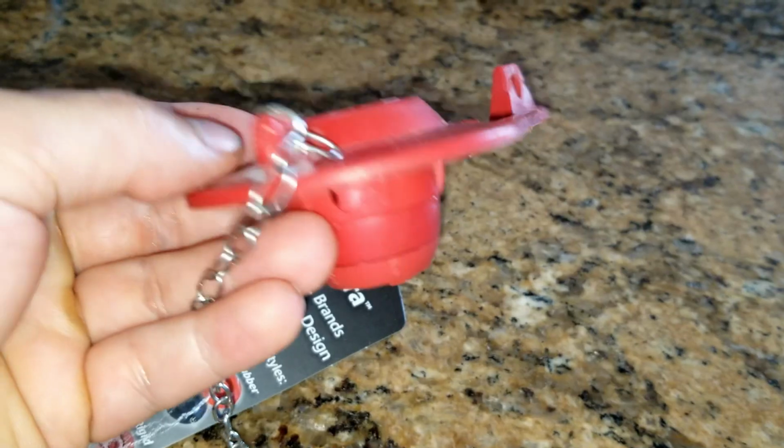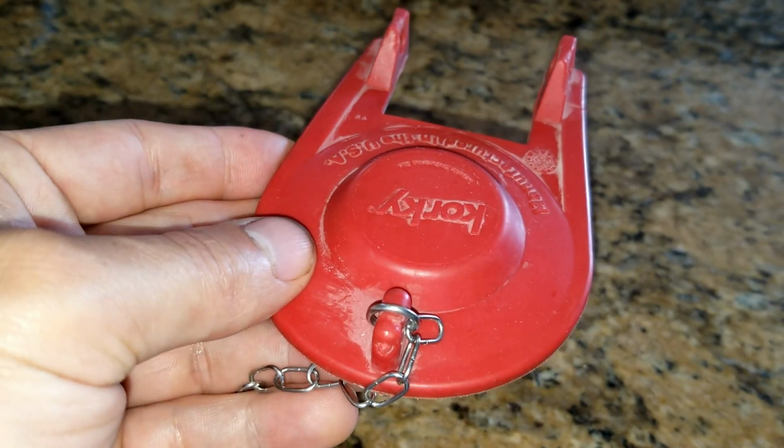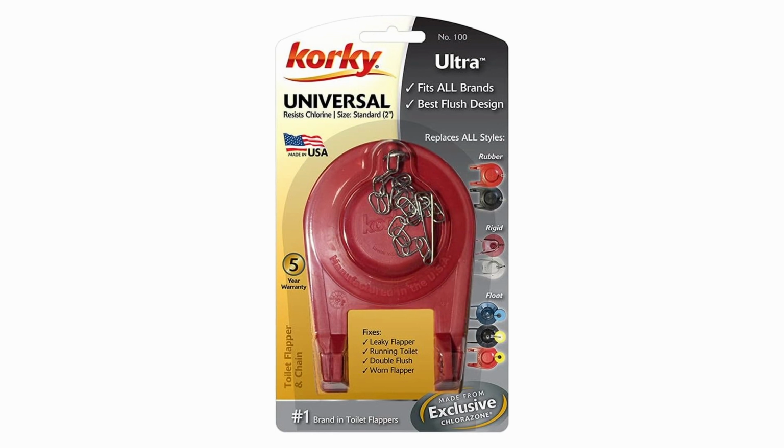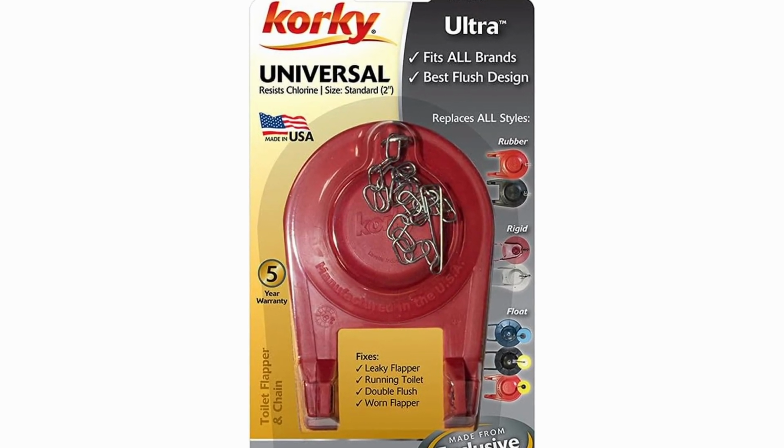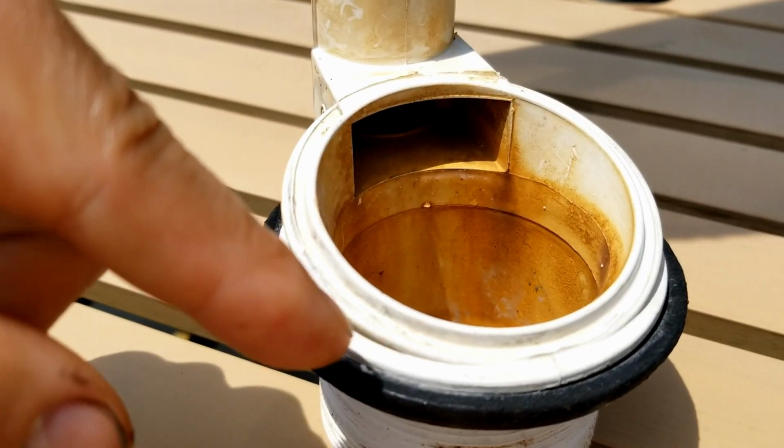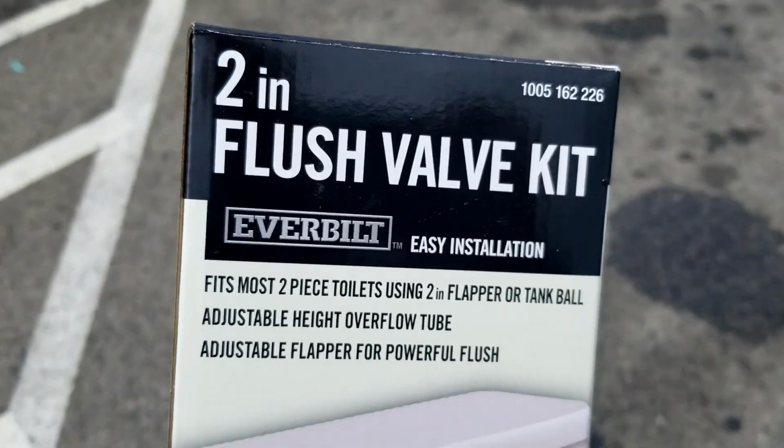With a constantly running toilet, it can only be two things. One of them is the flapper that you see here, which is very easy to install, and I do have a link in the description, so you could start with the flapper, or it could be the flush valve itself. So let's get it going.